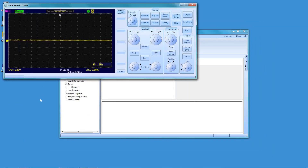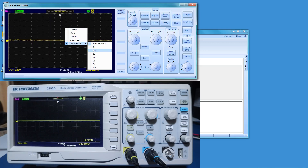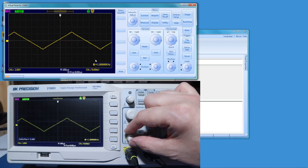Now we can click on the virtual panel, and you'll notice here that it's not refreshing by default. But this is really sweet — it has everything you have on the actual scope itself, just like a real virtual scope. Kudos to B&K Precision for this — this is fantastic! If you right-click on the screen, we can go to auto-refresh and tell it to refresh every half second, every second, every two seconds, whatever. Let's do every half second. Okay, so it's refreshing now. Beautiful! Let's give it a waveform. We can see the waveform coming up — it's 1 kHz exactly as I have it set. You can make all the adjustments on here, change the position, whatever. And if we change it on the scope, you'll notice that it reflects onto the computer.